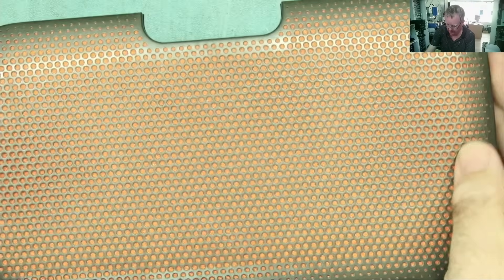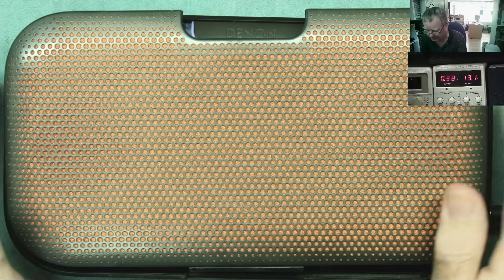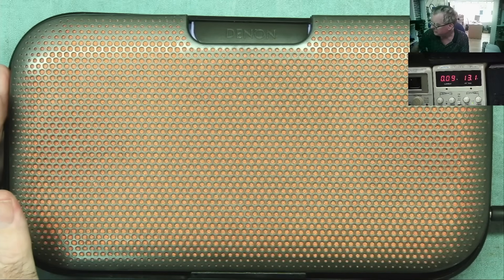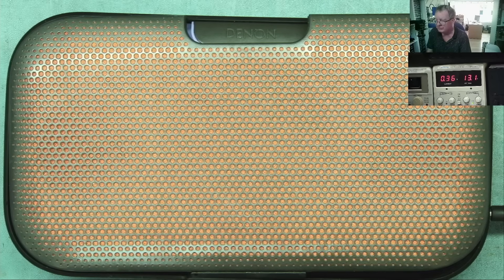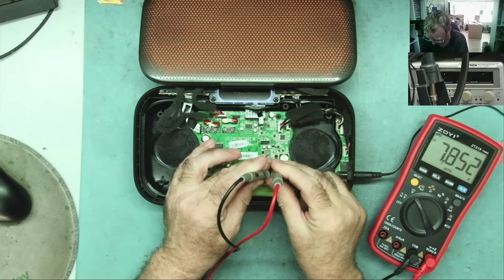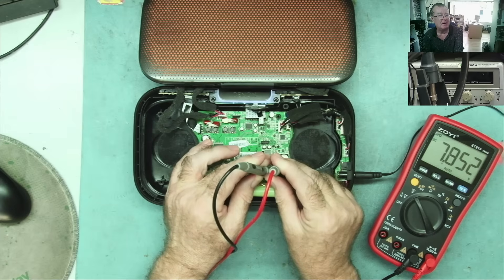So I've put it back together. Just connected the battery there. You see my bench power supply there — 13 volts. What's it do now? Do we still have a short? Oh, we've got a bleep, and it's lit up. So we've got a bleep out already, it's lit up. This now appears to be working. It's drawing — well, you can see there — it's flicking between about half an amp and not very much. The battery is probably totally flat. I would have thought that would have settled a little bit more than that, to be quite honest. Let's see what voltage is on the battery — 7.85 volts, that seems about right. So the battery is charged. I'm not quite sure why it's behaving in the way it is. The power supply now seems to have settled down to a fairly low current.